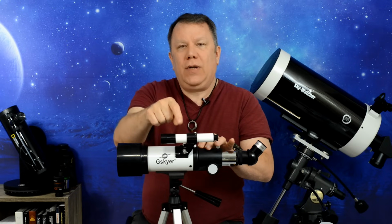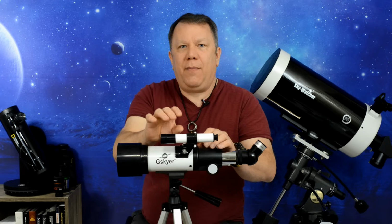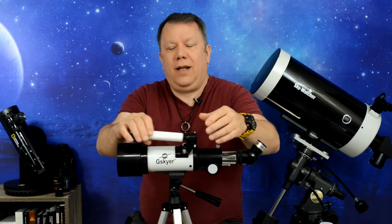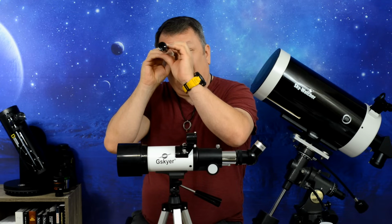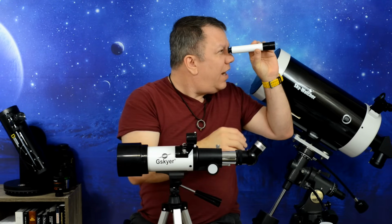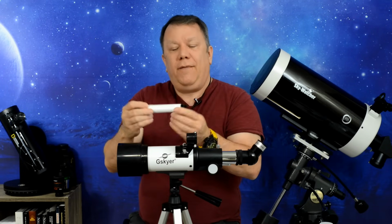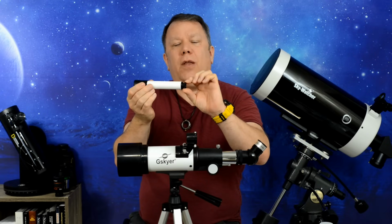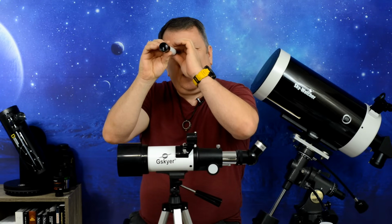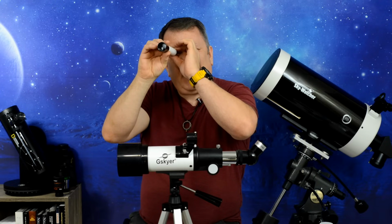Once you do that, then you can center this. And the first thing you're going to need to do is look through it and make sure that you can focus on an object. Now, for me, the easiest way to do that is, once again, take this tube back out, hold it up, look through, and you're going to want to hold your eye back just a little ways from it, just a tad, and look through, and you should be able to see light and the crosshairs, although it's probably going to be out of focus. If you look on the little end of this, you'll see a little knob, and you can twist and turn this to change the focus. So look through it, look at the object, get it pretty well in focus. Let me find something. There we go. Get it pretty well in focus.